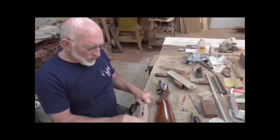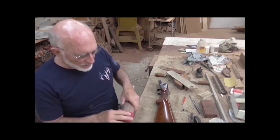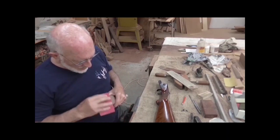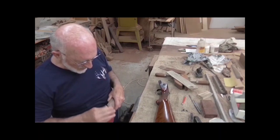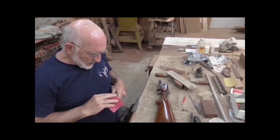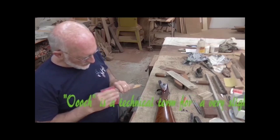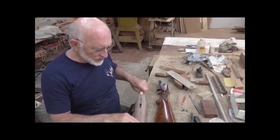After that, what I'm going to do to tweak it, which I know I'll have to tweak it a little bit, is I will add some stain to my finish. I can tint the finish and kind of ooch it a little bit one way or the other by tinting the finish when I put the finish on, because my finish is clear as water.